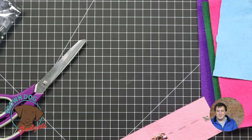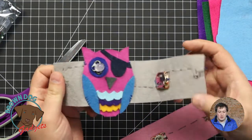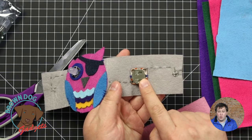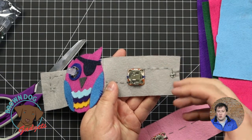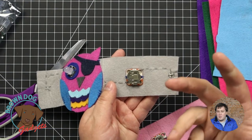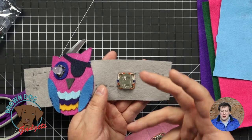So let's go to our wonderful overhead view and talk about conductive sewing bracelets and wearables. Yay, overhead view. So typically, when you're doing a project like this, you're going to be using conductive thread, you can see here, little stitches, with parts that are specifically made for sewing. Using a regular LED for conductive sewing projects is really obnoxious to do because the legs aren't meant to bend and twist, especially be sewn through. A lot of people try using them that way, but they just aren't great. They're not really meant that way.